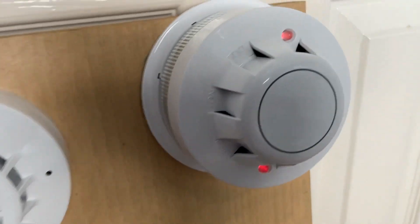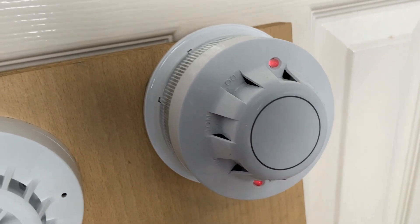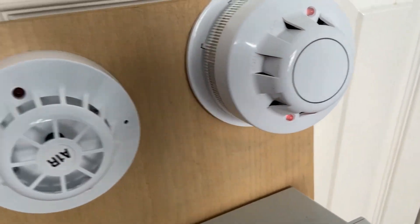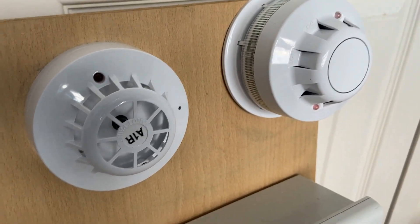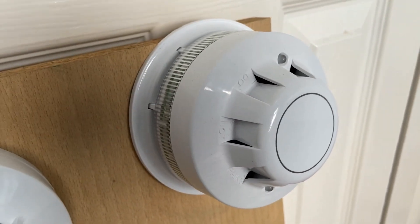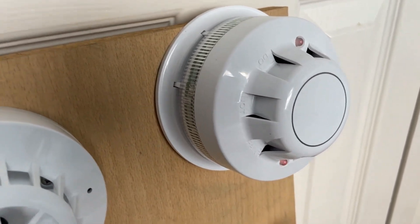So the optical is lit up — the LED is not very bright. I don't know why that is, but I'm going to press reset. Probably because it's on the sounder beacon base, but I'm not sure why the LED isn't so bright. Let's press reset — it might go off again. Just give it a second to see if it goes off. Yep.